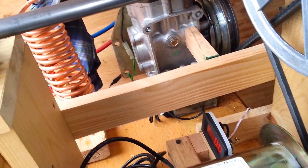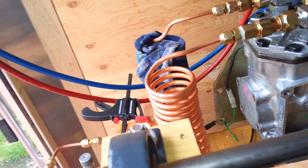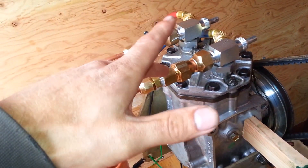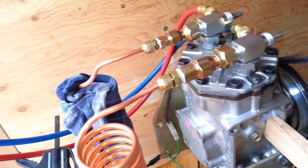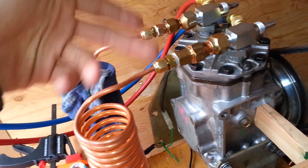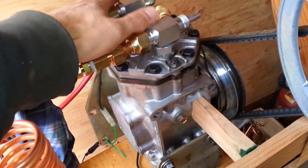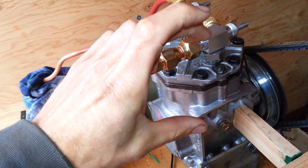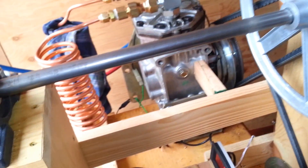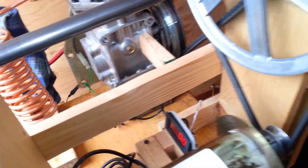The displacement in this compressor is about twice the volume of all the lines in the system. It's pretty incredible — these two pistons reciprocating, basically just exchanging gas. Discharge on the high side, suction on the low side, exchanging gas with every rotation. I have it running at anywhere between 100 and 200 RPM. But it takes an incredible amount of torque to turn this thing — one and seven-eighths inch pistons, two of them, with 1.866 inch travel, giving 10.3 cubic inches. Going direct drive, it didn't have enough torque. Could not get any pressure differential. The motor stalled, the belt slipped — essentially nothing happened.